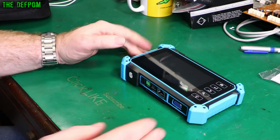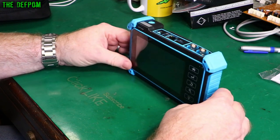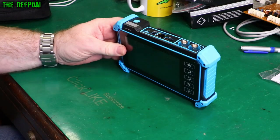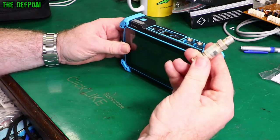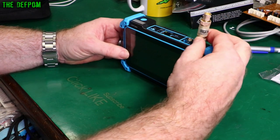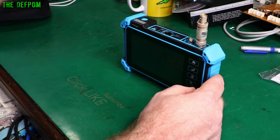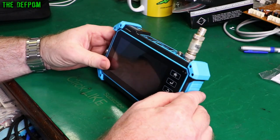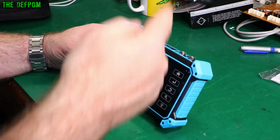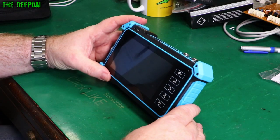Now there's a bit of an extension to that, the reason being is that I blew this up. What actually happened is I was probing around — I had a DC block, because you've got these BNC connectors here. It basically goes on a BNC like that, and it's got a capacitor in it, so it stops any DC from being passed through. As video signals are AC, they can still pass through. So that way you can use AC coming through, but it doesn't let any DC through to the input circuitry. Which was working fine, until I made a mistake.